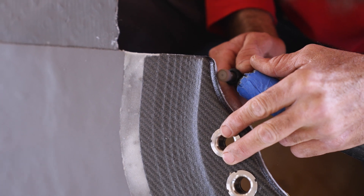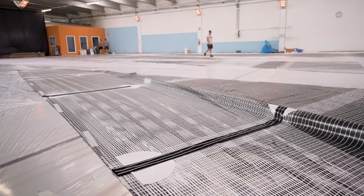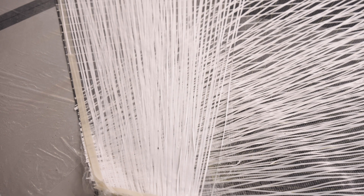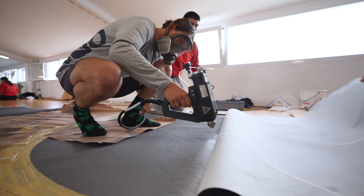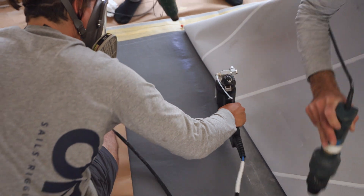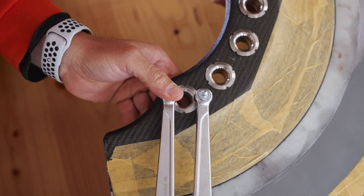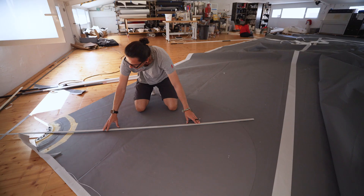It has different holes to locate the sheet, so you can choose different holes depending on wind strength, conditions, and your angle to the wind. The beauty of 4T construction is that we can laminate a hard point to a corner, knowing that the load will be transferred to the entire sail. The fibers start at the clew and in an uninterrupted fashion, from the same reel without any cuts, go all the way to the head of the sail. So the clew load from the staysail or jib sheet is transferred throughout the whole sail without any hard points, overlaps, or joints.